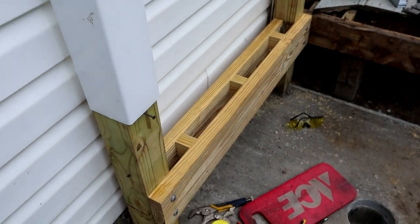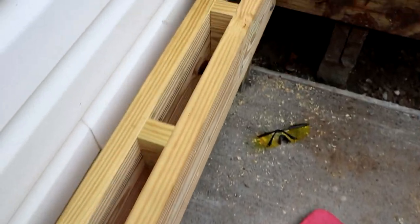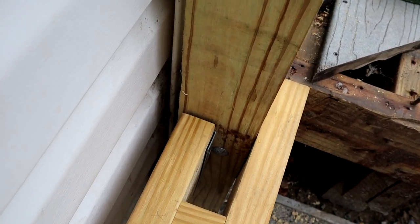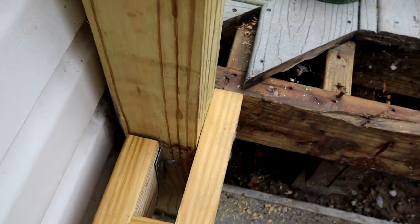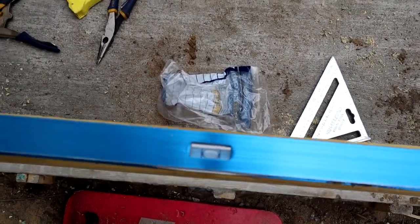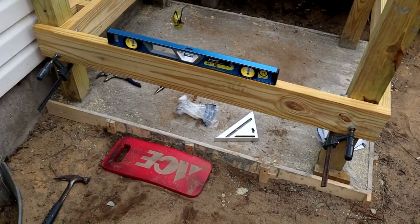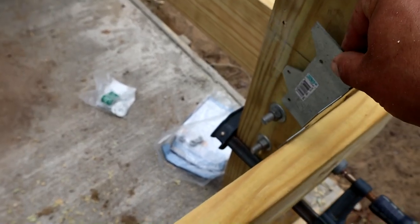That's all attached - this was not any fun getting my hand back in here threading those nuts on, especially over here by the corner of the siding which eats up a little more real estate. I had to cut the ends of the carriage bolts off in order to be able to thread on those nuts on the back. If you do that, give it a little coat of paint to protect against rust and corrosion. If you did everything right up to this point there shouldn't be any issues getting this last board in level, because all you're really doing is connecting the two points together. Got it clamped in place temporarily - going to secure it to the posts and finish it up with some corner brackets for a little extra strength.